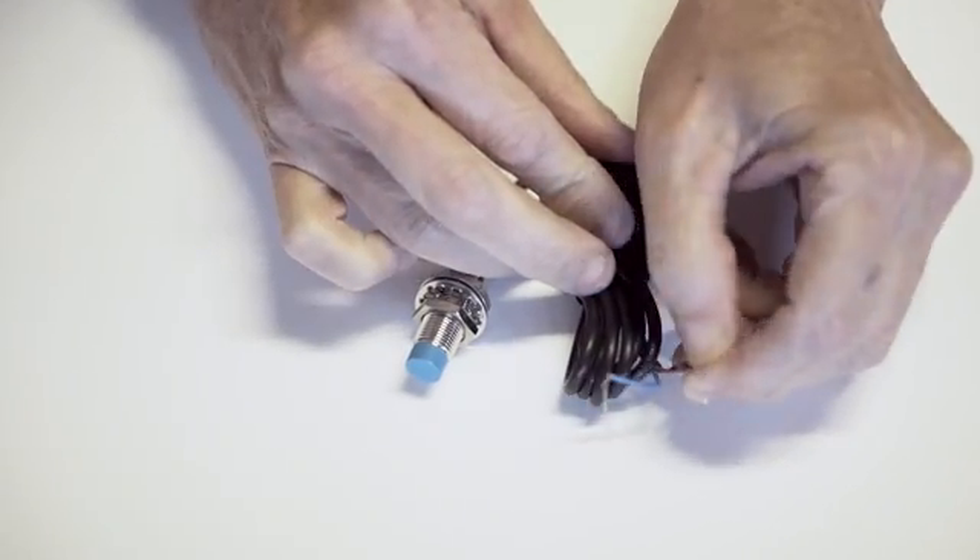You can see that when I put the metal close to the proximity switch we got a reset — M1 plus plus limit was engaged. Let's press reset again and do that again. Moving the metal closer to the proximity switch, watch the M1 plus plus limit — it lit up, and as I move it back and forth the M1 plus plus limit is going on and off as well. So that's how to connect the proximity switch to a CNC controller.